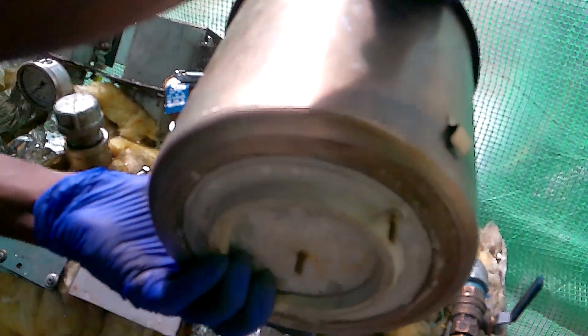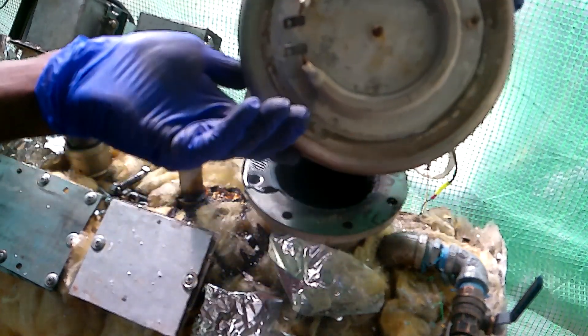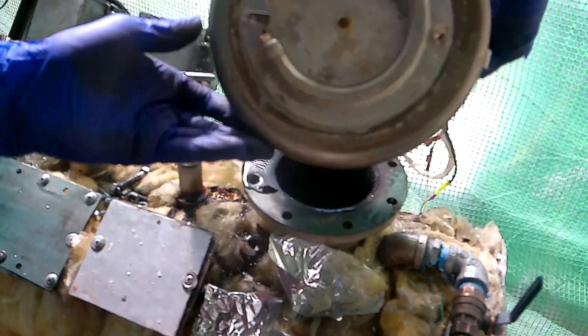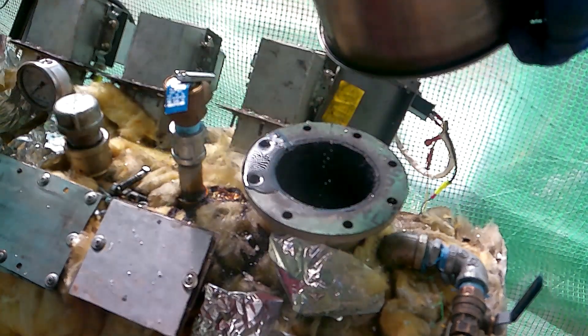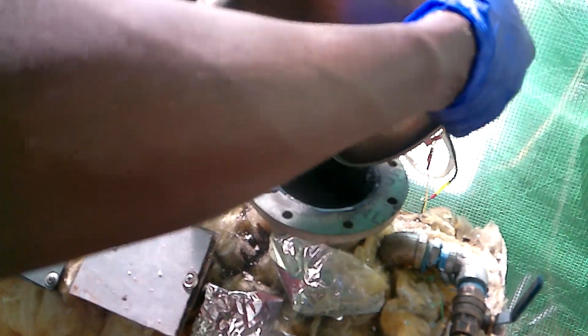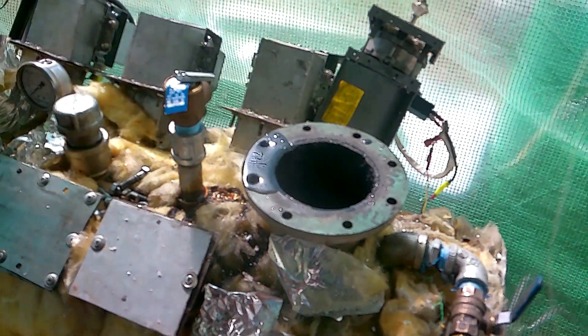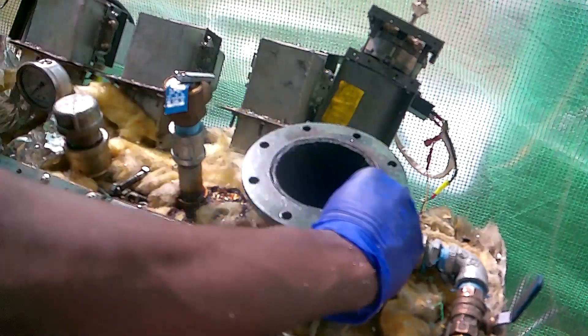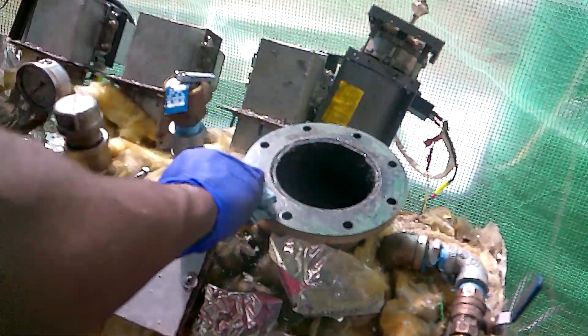So that's why we're adding this motor oil — it gives us amazing results. It almost acts like a catalyst of sorts. The motor oil itself does not absorb microwaves, so what happens is the plastic absorbs microwaves, gets hot, and that heat transfers to the motor oil, which then causes it to break down — but it takes a lot longer because it really does not absorb the microwaves at all.